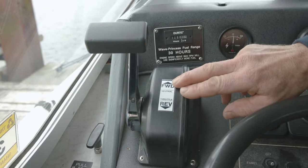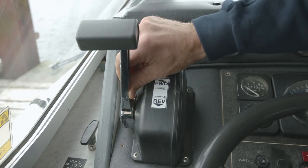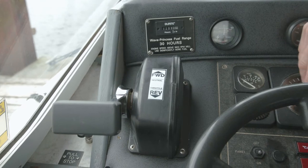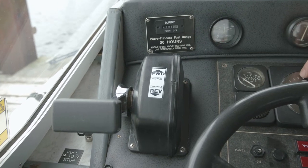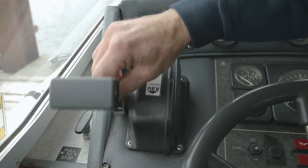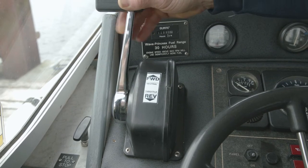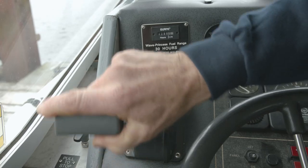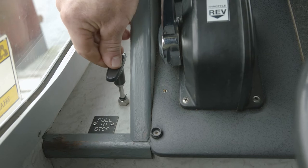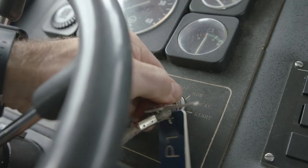This is your morse. At the moment it's in neutral. So if you need to charge your batteries or heat your water, just push it out and pull it back. This disengages the propeller from spinning, giving you a higher rev on your RPM clock to charge your batteries. When you want to move off, just put it back into neutral — it pops in. Push it forward for throttle, neutral, and reverse. Then to switch it off, you pull, push it back down, and turn it off into the off position.